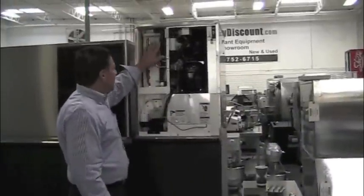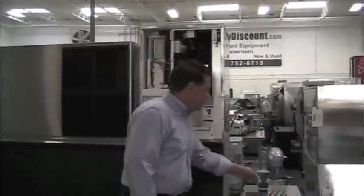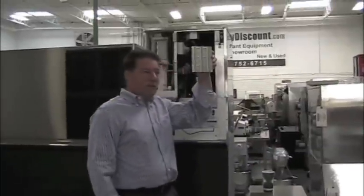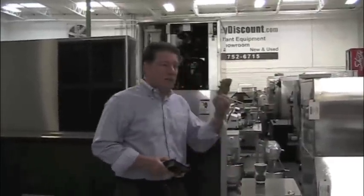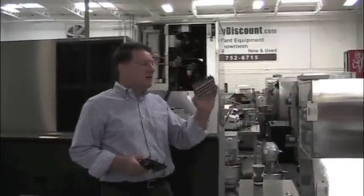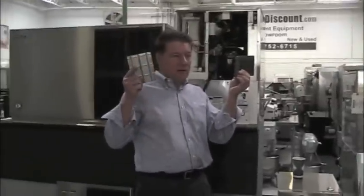This is the ice making category area right here. We keep it as clean as possible. These machines are extremely easy to clean — all you have to do is run a brush from the top to the bottom, compared to these units right here. This type of configuration for an ice making evaporator has to be cleaned twice a year. This one only has to be cleaned once a year.